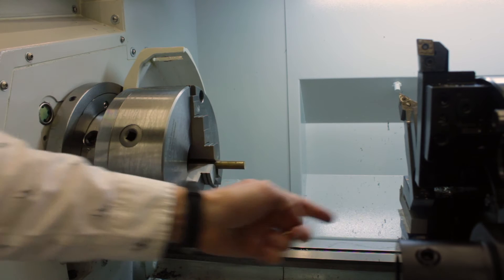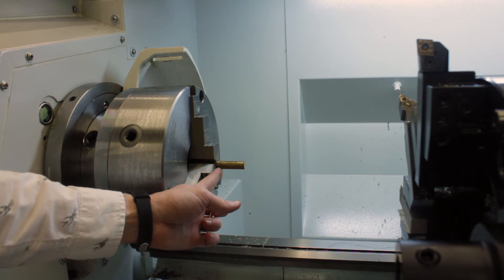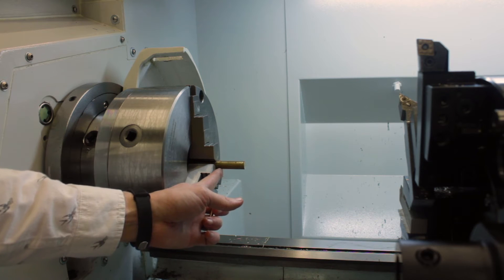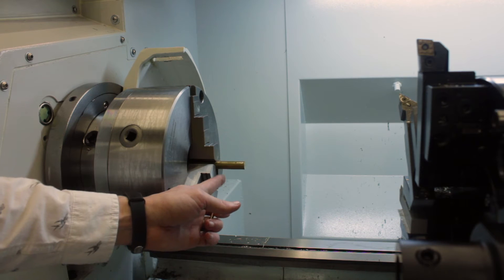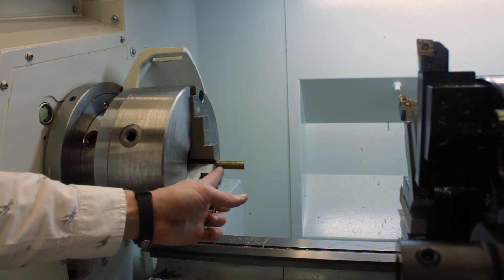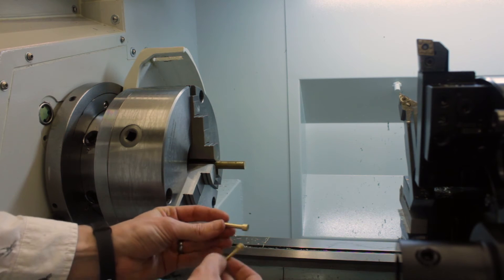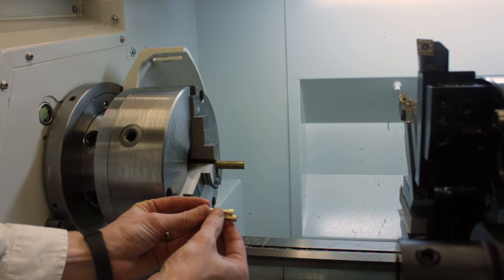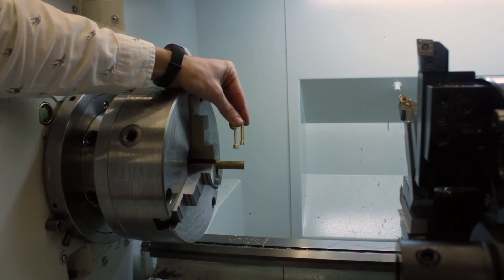When you're working so close to the chuck, the grooving tool is 3mm and you're only a couple of millimeters away from the chuck, so it's absolutely essential that this is dry run without any stock and stepped through block by block. We've got a few videos showing dry runs and single blocking. So that shows how such a simple piece of setup can make a massive difference to the accuracy of the workpiece.